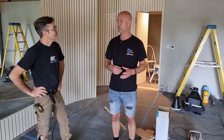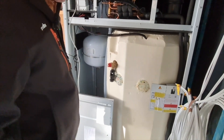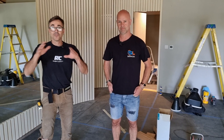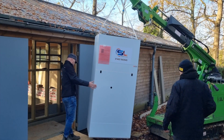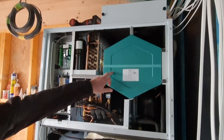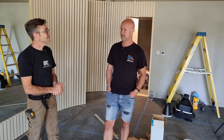Essentially we're using a heat pump to heat, preheat, or pre-cool the incoming air from outside. There's a water tank built in — it's a DX coil in the tank, so straight out of the compressor the hot gas goes through a coil. Your boiler heats water through the coil; we push hot refrigerant through the coil. The unit is like a big American fridge in size. Inside there's a hot water cylinder and a small electric boiler for underfloor heating, and the MVHR is at the top — all working in conjunction efficiently.